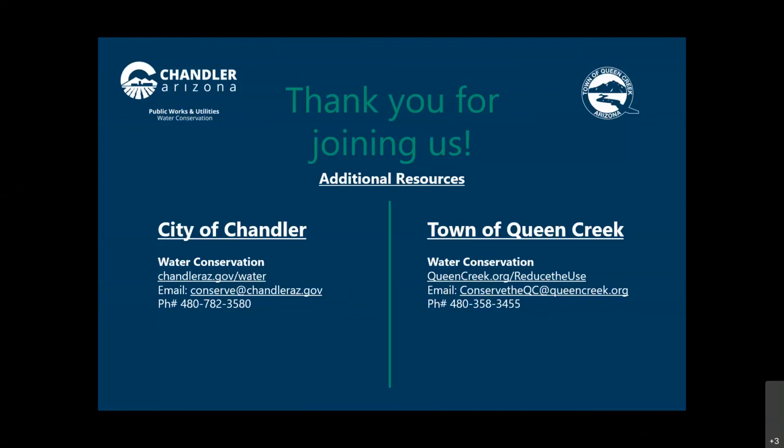Driveways, hopefully there's already a sleeve there somewhere. If not, do not try that water jetting trick because you'll remove so much soil underneath that driveway. The first time you pull your car onto it, it's going to collapse. So then you've got to reinstall your driveway and then make sure you put in sleeves when you do that so you don't ever have to do that again.